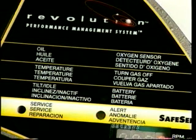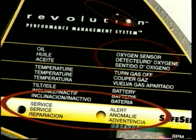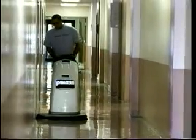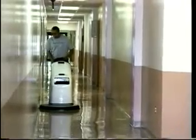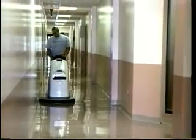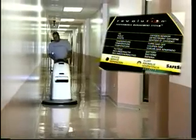As an added feature, Revolution's lights stay illuminated for 20 seconds after shutdown to help technicians troubleshoot any problems. Pioneer Eclipse's unique SafeSense emissions monitoring system works by constantly monitoring the machine's exhaust with an internal oxygen sensor. The amount of oxygen in the exhaust correlates to the level of carbon monoxide emissions. When CO levels begin to approach a preset limit, SafeSense first warns the operator with a yellow warning light.